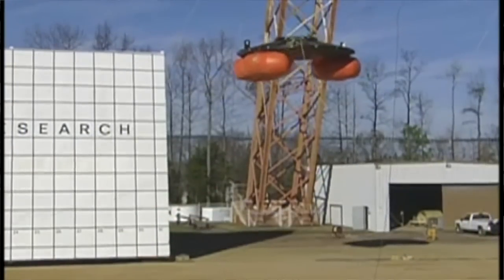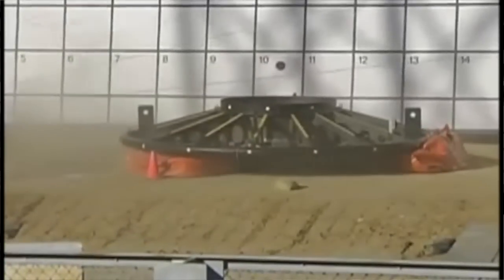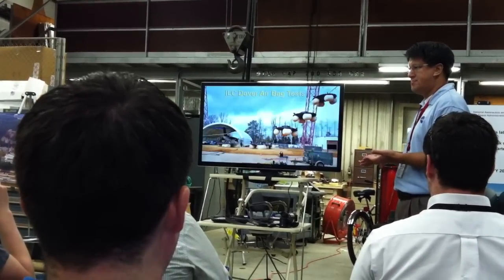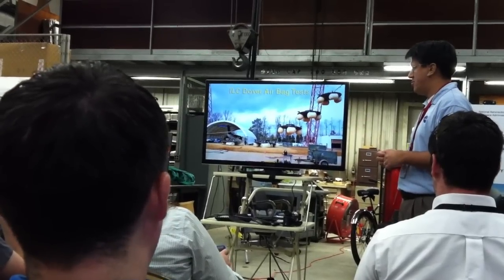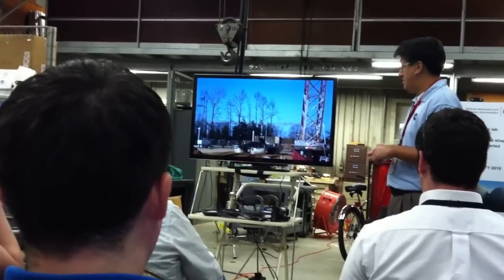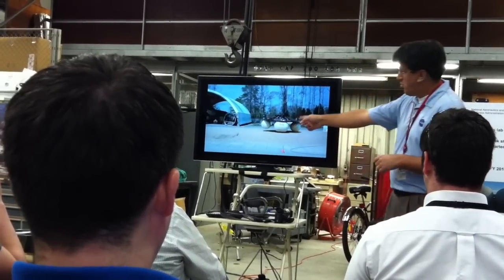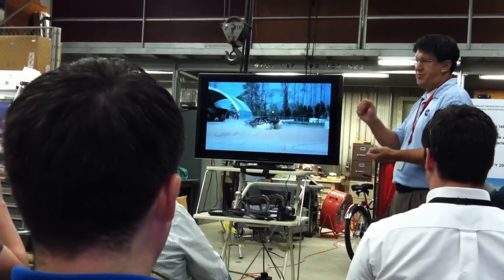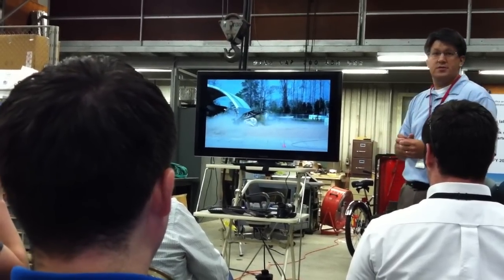Now let's put it into a swing and see what happened here. It doesn't behave as what you would imagine with a drop — it introduced shear loads into something that behaves much differently. Here's another company, another center that came out; we start with a drop. The drop looks really good, we've optimized the design. But as you get to the swing part of it, you can see what happens to the front — the front completely decimates. The air loads just rip out the inside and the outside airbag. This is one of those head scratchers that you don't really know until you test.